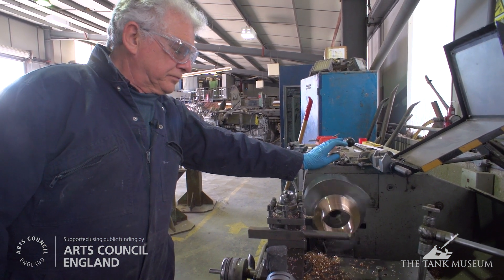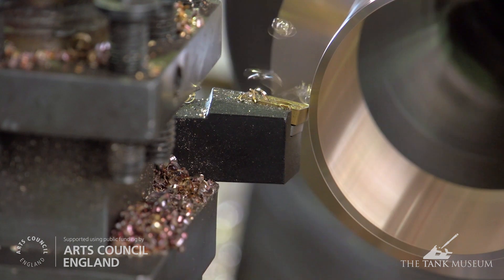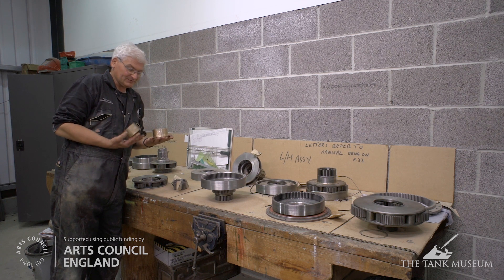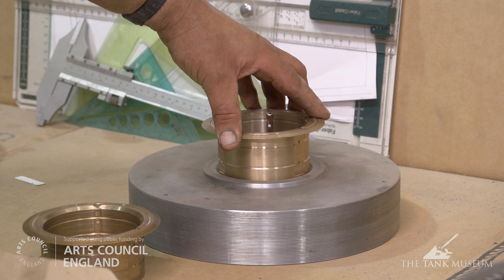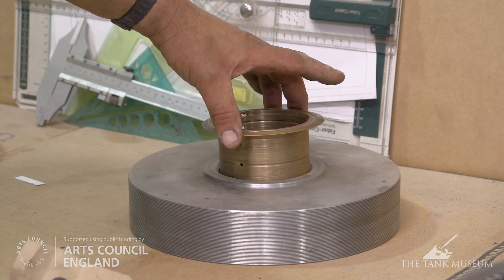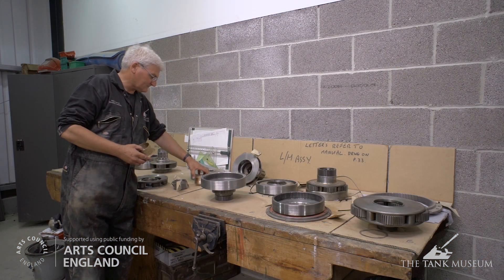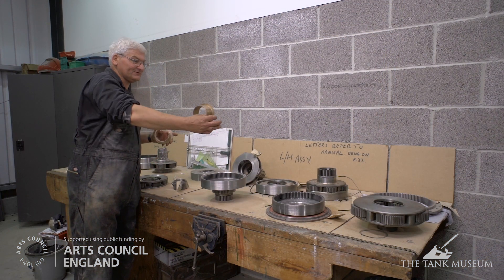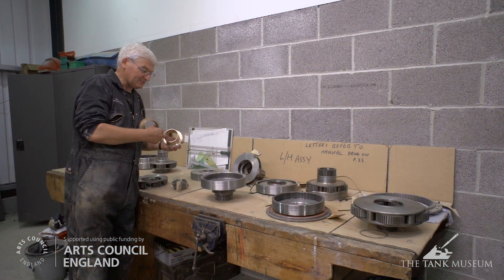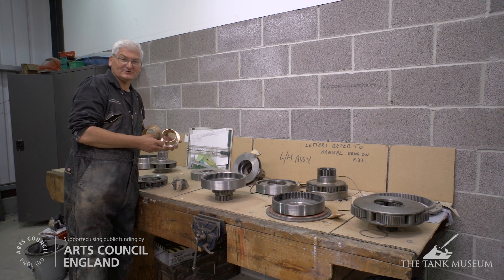One of the big challenges has been to actually reproduce these bronze bush components. We have a very skilled volunteer, Mr. Bob Kendall, who has been doing a huge amount of work, and we've tried to reverse engineer these bushes. Because we don't have any of the manufacturing drawings, we can't make them to exact size. This new bush is intended to replace the worn original — as you can see, it's not a sloppy fit compared to the original which just drops in. We'll shortly commence a test reassembly with all the brand new bushes, doing some trial and error and polishing until all tolerances are right, then we can reassemble the gearbox in total.